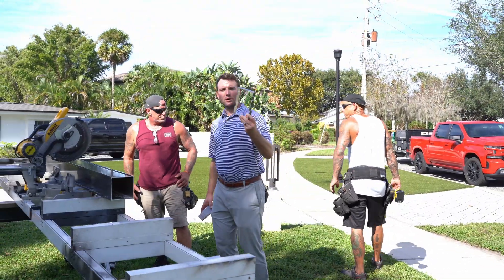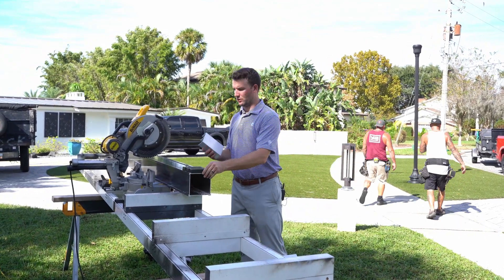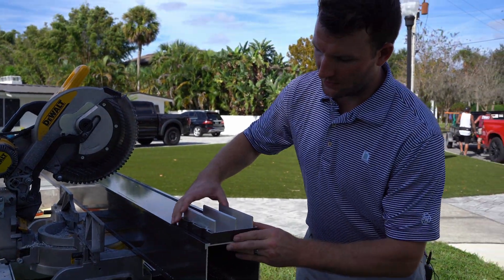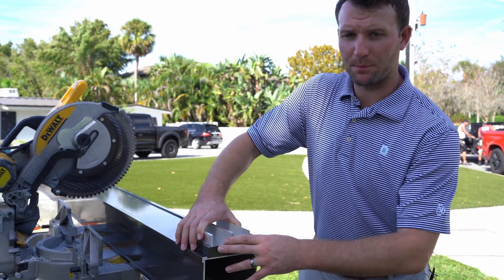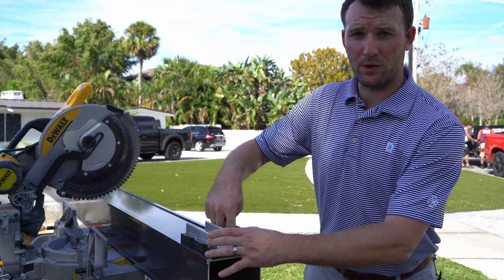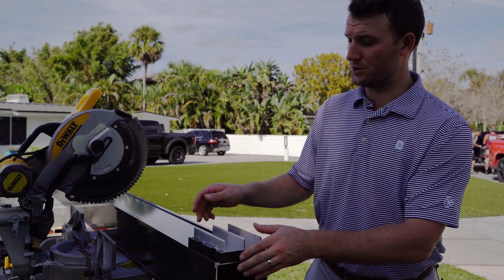We cut off a piece of the beam so we can use the beam end as a template to attach our clips. With that template, we know when we put it up inside the beam with the clip, that the template is completely flush with the beam, and our clips are laid out perfectly so we can attach our through bolts on the ground. It's a lot easier to do on the ground than to get up on a ladder and try to drill the holes for the through bolts — this is a much faster approach.